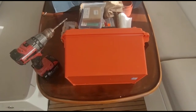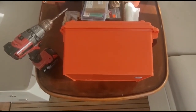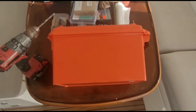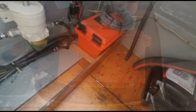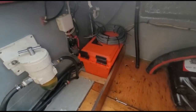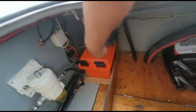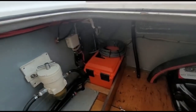I'll put on the waterproof fitting to seal off the terminal. Here's the box where I'm going to store the router and also the inverter. I'll poke a couple of holes with the drill and a hole for the Starlink cables to pass through. It tucks in the corner nicely — the router and inverter just sit inside the watertight box. That's where they'll live.